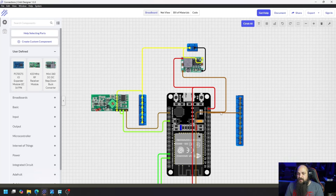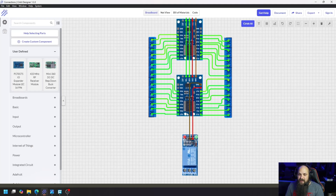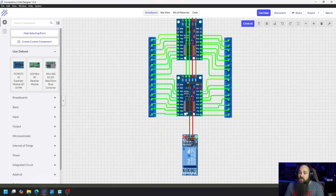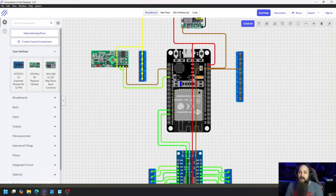From the buck converter I connected it to the VIN pin and the ground pin. You'll see it also comes out this side - there's a bunch of headers for the ground side where I can connect all my grounds. On the 12 volt input side I also added a couple of 12 volt terminal blocks. Scrolling down you'll see the expander boards - I'm connecting two of them, giving 16 inputs each, expanding the ESP32 with an additional 32 inputs or outputs. I also added a relay to trigger a siren in the future.